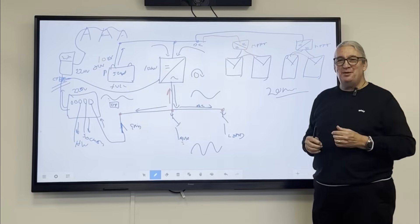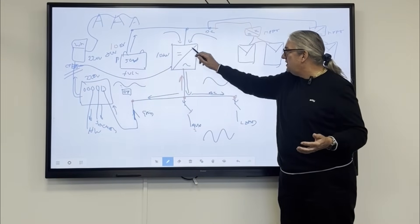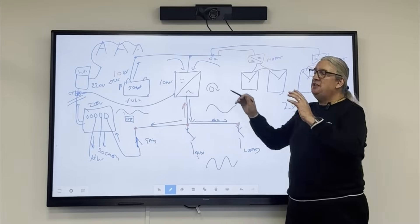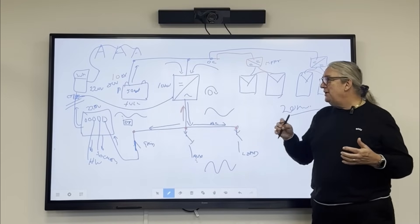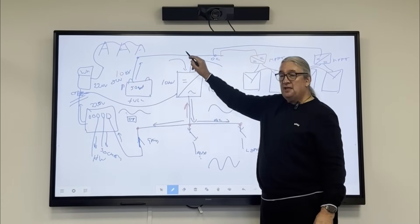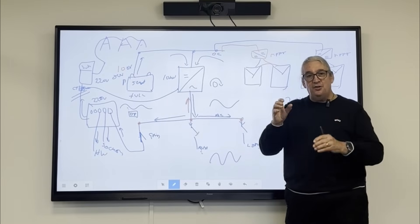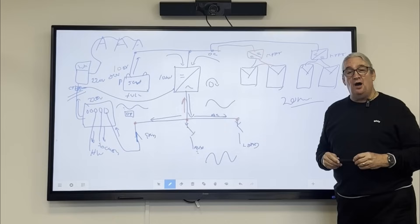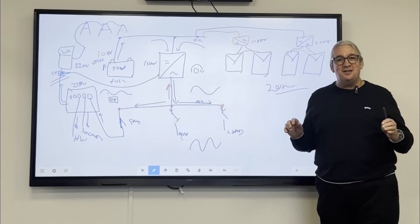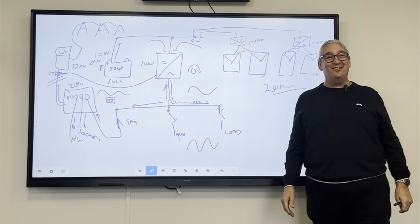I hope this simple explanation works — how the actual inverter works, pointing out that the inverter is just one machine stuck between two bus bars: an AC bus and a DC bus. Everything on the DC side is connected to DC, everything on the AC side to AC. The inverter goes both ways — it can charge or discharge, sending power from AC to DC or DC to AC. That's the magic of it. The MPPTs are just like little inverters — DC to DC converters. I hope that's useful, thanks for following us, subscribe, and let me know if you want more explainer videos.